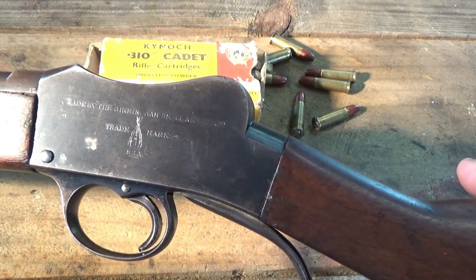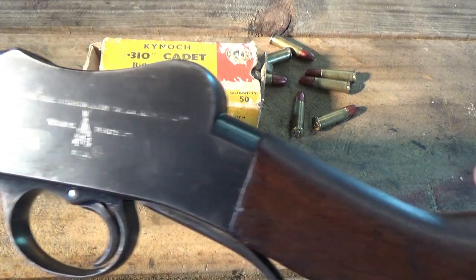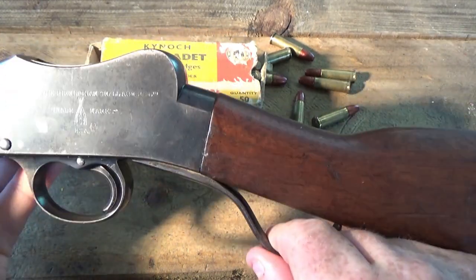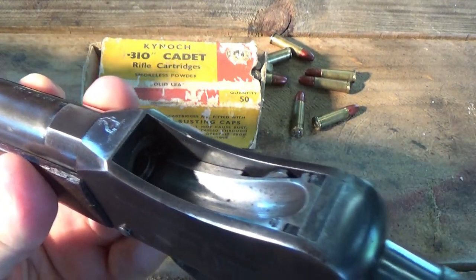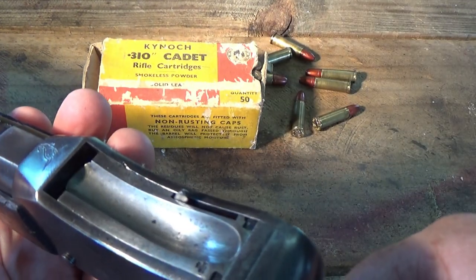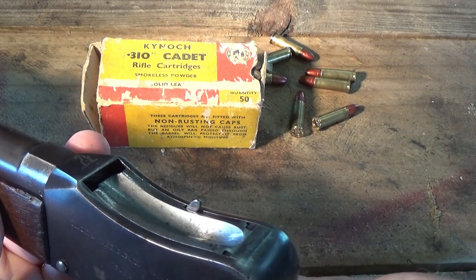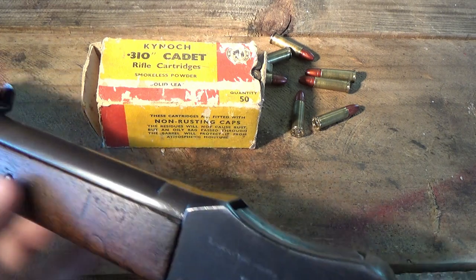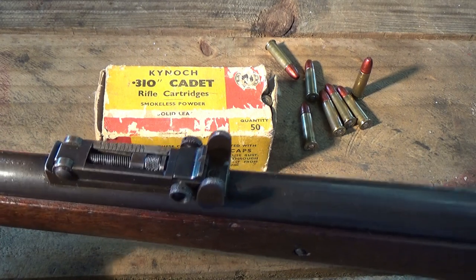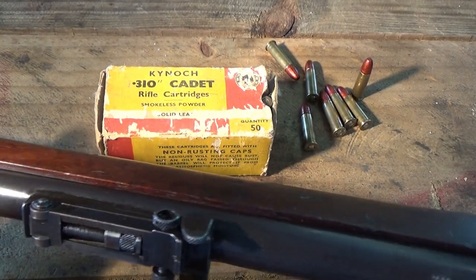This one, as you can see, is manufactured by Birmingham Small Arms Company Limited. It's got a trademark and a little symbol with cross rifles on it. It's kind of like a lever action gun where you open the breech with a lever, load one round in and close it up again ready for firing. You can see at the top here is a little cocking indicator that sticks up when it's in the cocked position - when you pull the trigger, it drops down. This one's got what they call the second pattern sight, which is a thread-adjustable sight, fitting the purpose of teaching cadets marksmanship.